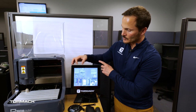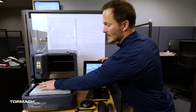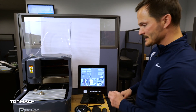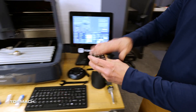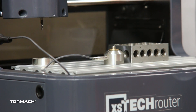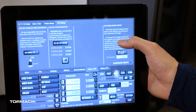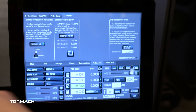In recap, we've established our spindle and our G37. The last thing we need to set up is the length of our actual toolsetter — how high it is from our table. We'll do that by establishing a work offset. We'll get a 1-2-3 block — any type of solid block that's not going to compress will work. We're going to place the material on our table, move and set the work offset button to measure the electronic height setter, remove the tool from the spindle, and change to tool zero using the 1-2-3 block to reference the spindle.